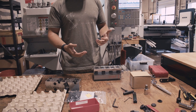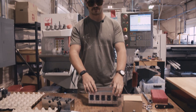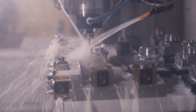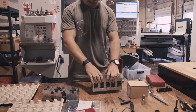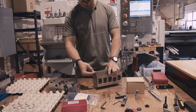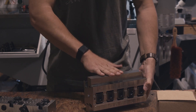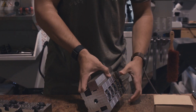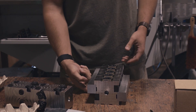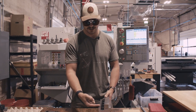The other cool thing about a tombstone when it comes to multi-axis machines is that I don't just have access from the top. On a three-axis machine using a pallet, the pallet doesn't move, so I can only access the part from above with the spinning tool — I can't turn to the side or anything like that. But on a tombstone, it's made for multi-axis, so for example on our buckles, we machine the rims so that the shape is kind of like this. But those rims have holes in them for the spring bar that holds them to the strap. And in order to do those holes, while it's still working on this piece of material, it will flip the tombstone on its side and drill those holes from the side. So we can access the part from three different sides on this tombstone, as opposed to if we didn't have a tombstone — we could only access this part from here and we'd have to set up a secondary operation just to drill those holes.